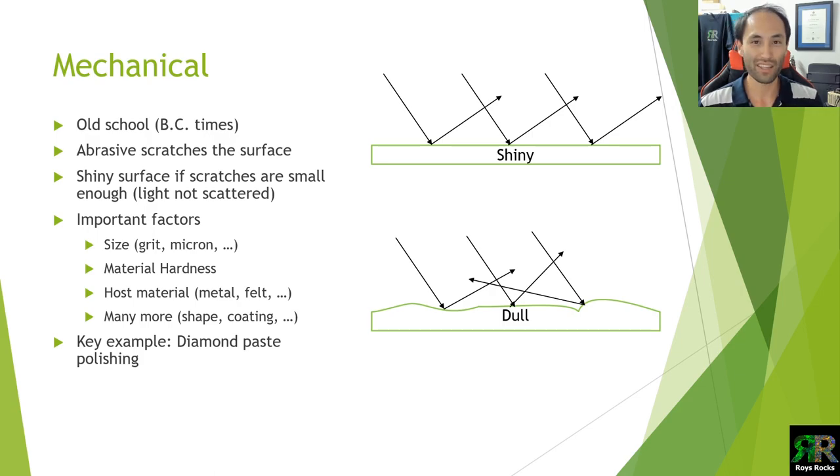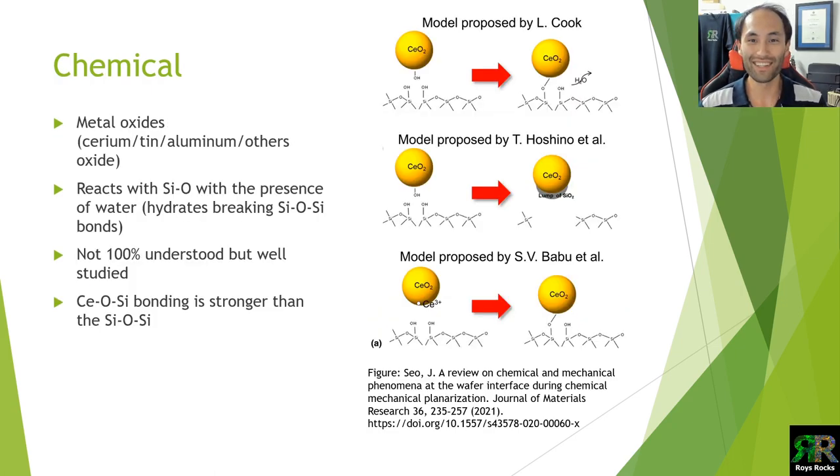The shapes you're going for, coatings on the abrasive grits — specially coated diamonds and so on — it's very interesting but in essence it's still simple: you're just putting a coating on to change things. The key example is diamond paste polishing. However, when we move to the chemical side it starts getting more complicated — so complicated that the science isn't fully settled on how the actual process works. There are lots of models and they all seem feasible. There's a great review article describing chemical mechanical phenomena at the wafer interface during CMP, and you can see from the models they're looking at silicon oxide, the same as what we're doing with opal.